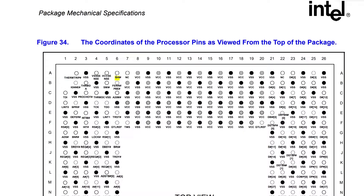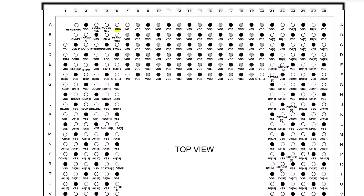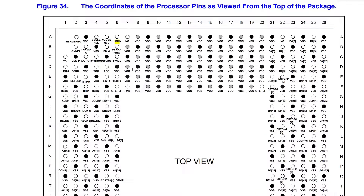Basically there are two ways of doing this. One way is for something like the ASRock boards with a through-hole socket, where you have access to each and every pin at the back of the board. You can just hook up your wire directly to the pin with a pull-up and a dip switch to ground. On the ASRock board specifically you need to cut a trace between the VCC pin and the GHI pin, as well as a trace between the VSS pin and the deep sleep pin - because ASRock, being ASRock and saving costs, just put traces to have the pins connected with no resistors.